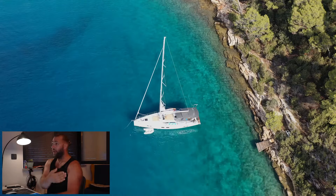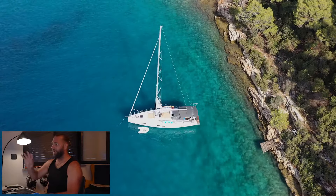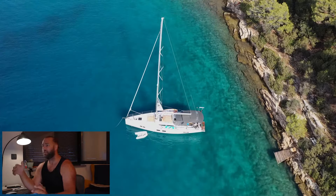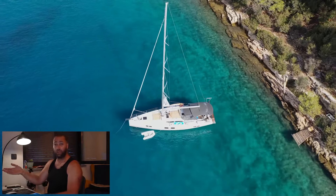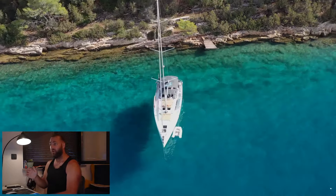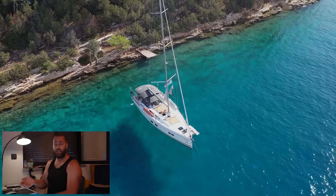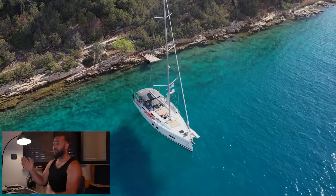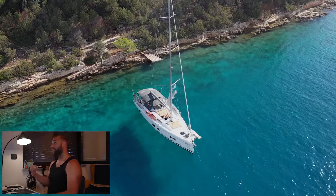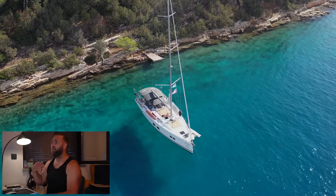Now we're in neutral, with tension on both the stern line and the anchor chain. I want to sit right here because it's lovely swimming off the back. If you're doing this overnight or expecting a lot of wind from astern, I would not suggest being this close to shore — give yourself more space. If you've got 50 to 60 meters of chain, I'd want all of that out, starting deeper and laying it back further. You can ease stern lines and go out further, or ease anchor chain and pull in the stern lines, depending on conditions.